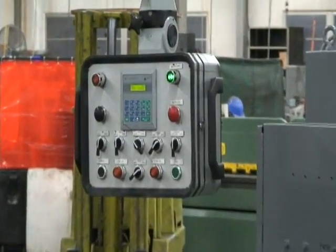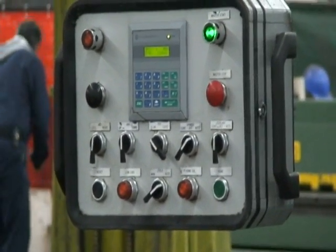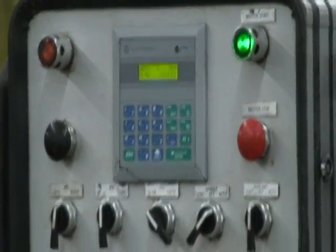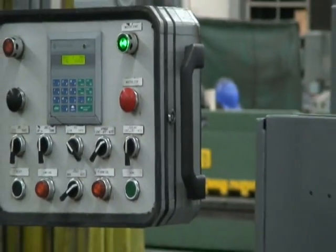This machine has a little higher than the standard column. It has 36 inches of table travel. The table is 15 by 63 inches, and it currently has a 10 horsepower motor, although 15 or 20 horsepower are available options.